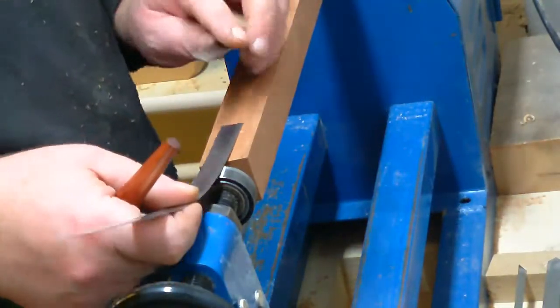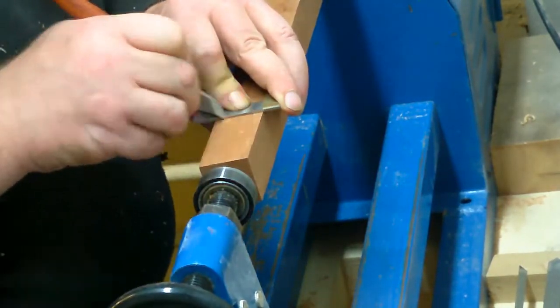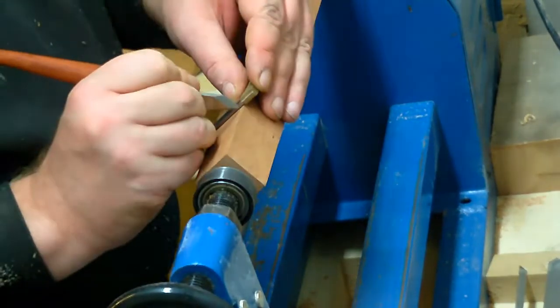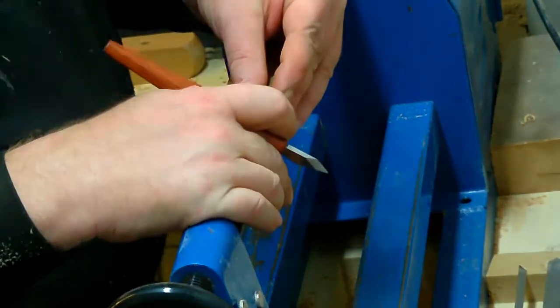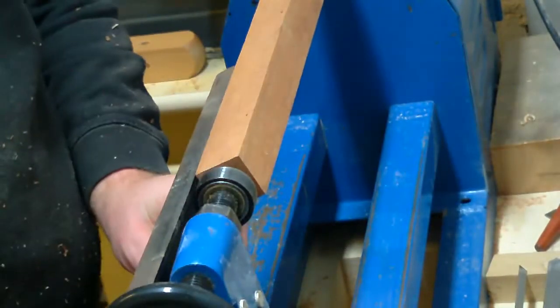The simplest connection between the base and the stiles is a dowel. As a rule of thumb, the dowel should be 1/3 of the thinnest material for the maximum strength. So the biggest drill bit I own is a 15 mm one. As you don't get dowels this size, I took the stiles over to my lathe and turned the dowel to one end.